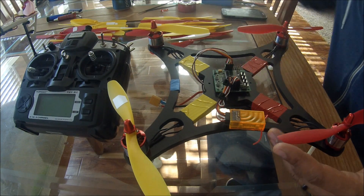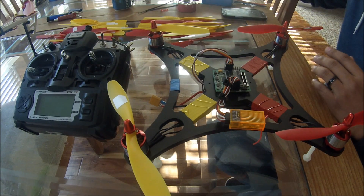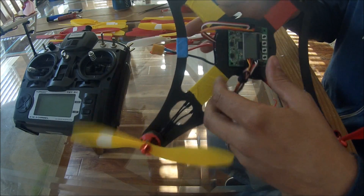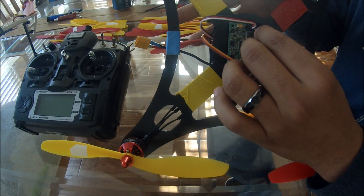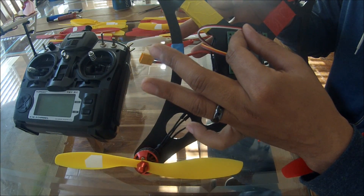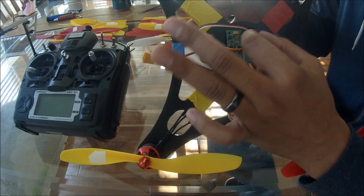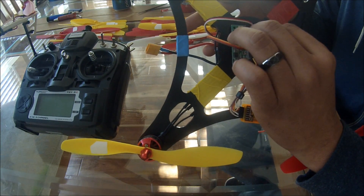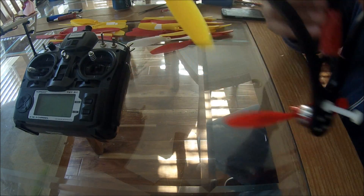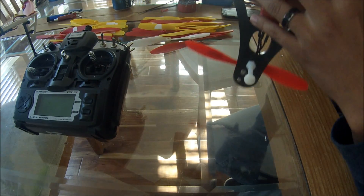The instructions had S1 through S4 — your motor hookups — going into the control board. I'm using the KK2.0, and it had the power cable going into the third motor, which wasn't giving it power. So what I did was switch S3 to go on motor output one of the KK board, and switched that with motor three — pretty much just switched the red one and the white one. I also switched them on the speed controller, swapping motor one and motor three connections so they would be in sync and in correct rotation.